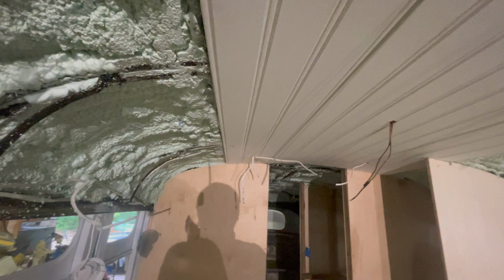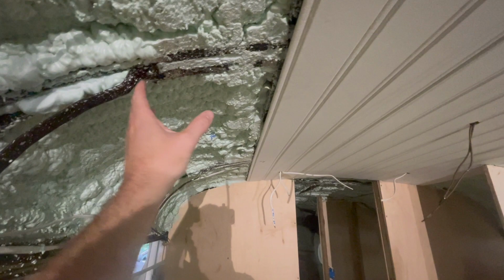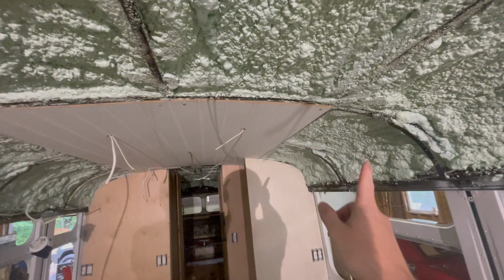And then this panel is so thin, I'm not going to do the baseboard. I thought about it, and I think it'll actually look worse to have a thin piece of baseboard with a gap and caulking here than it would to have just a large filler. So the large filler is going to be like a 1x10 piece of pine, very simply done, quarter round on either side, just to keep it really simple. And that'll cover that space there. I actually think it's going to look really, really good. By having that straight piece differentiating between here and the tin, it's going to make the ceiling less busy than if it was just these lines straight over to the tin.